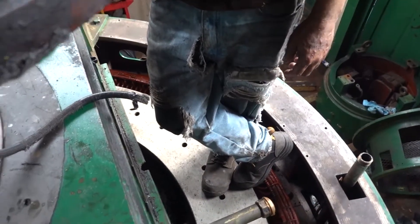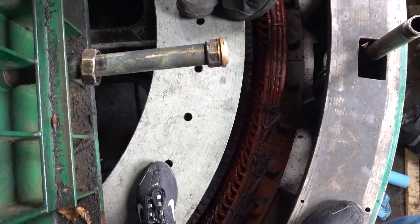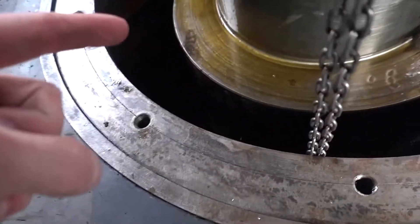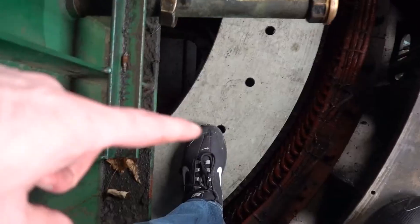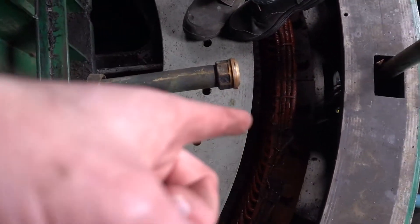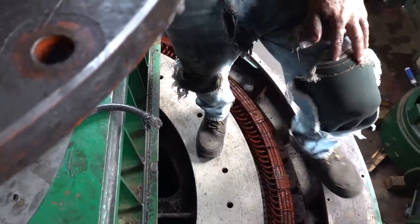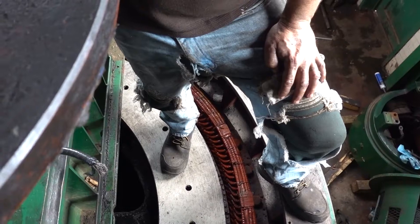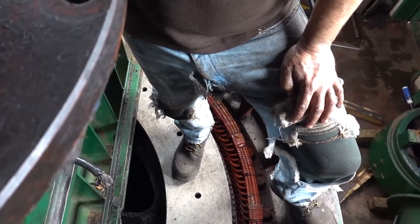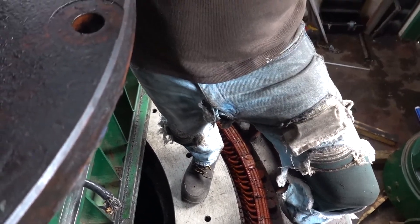Bootsy, I did a lot of cleaning down here on that stator, and the reason I had to do a lot of cleaning on the stator is because there was oil dripped down from the oil tank up here — because this is a flooded bearing. That oil dripped down onto the rotor, which is what my foot is on right now, and that flung it out through the stator and all over the powerhouse. So in the process of cleaning and taking this whole thing apart, you learned what the real problem was.